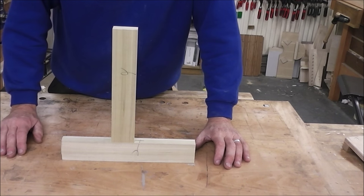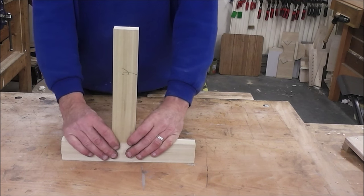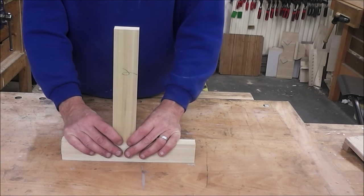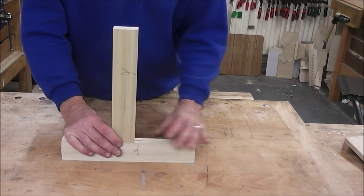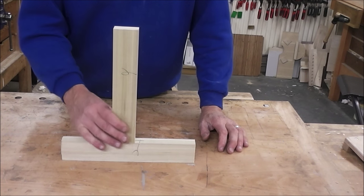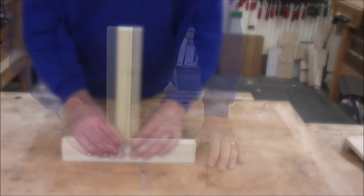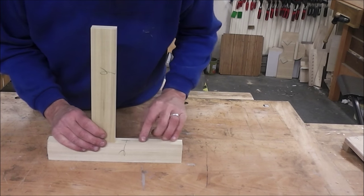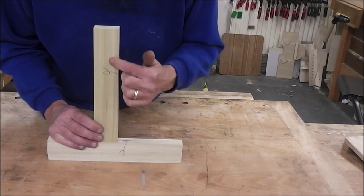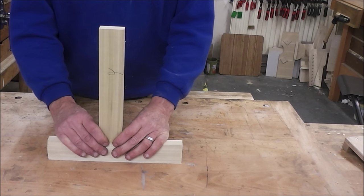So this is the sort of configuration we're going to be making the joints in. It's a rather fake situation — I don't know of many situations where you just cut one single mortise and tenon joint; you'd usually do them in a set. If you were making a door or a table or something like that, you'd have a whole set of joints and the critical dimension would be the distance between the shoulders. So this is just an exercise in how to lay out and cut a single joint. You can see I've marked up a face side and face edge — these are our square reference surfaces. Our two face sides are going to be orientated the same way and we're actually joining into a face edge, which is the standard way of doing a joint like this.